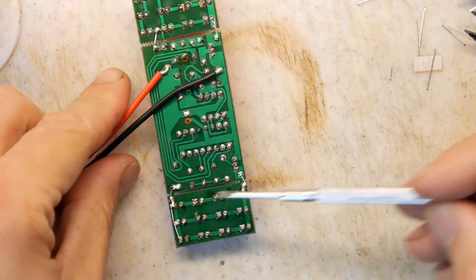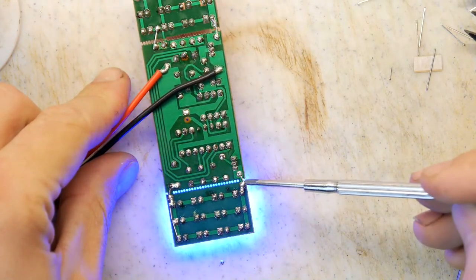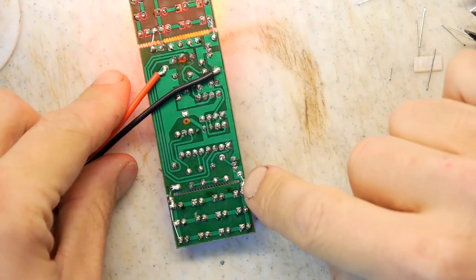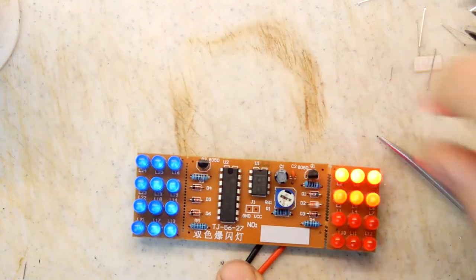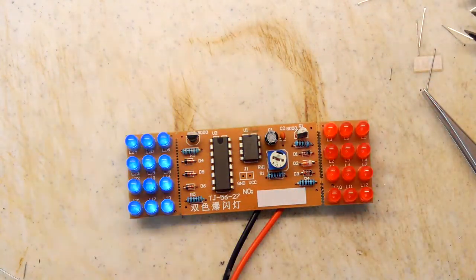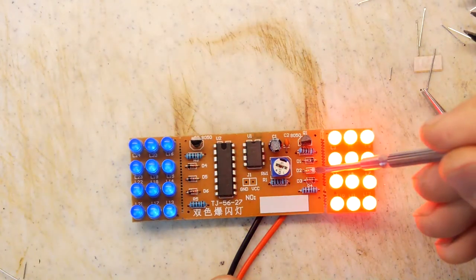I think there was some sort of microfracture on the PCB, perhaps as part of this hole being broken. Remember, it was broken off when we found it? No, that was the other side, right? Maybe not. Something weird's going on here anyway. If you flex the PCB, you'd lose certain rows of these LEDs. So I've gone round and bodged different bits of lead over the back and reinforced that, and it seems fine now. I found a signal diode, chucked that in.